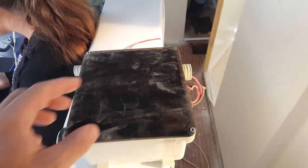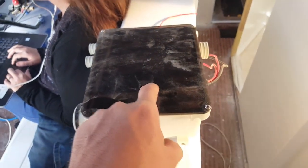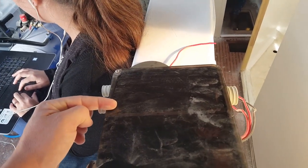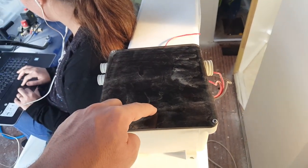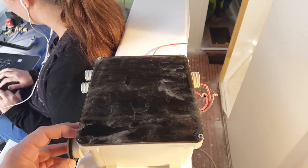So what happens is - I'm sure you guys are familiar with these, they're quite common. You can see through there, it is see-through, it's just dirty now because it's been in the dust. That's the pump outlet through there. There's a little bilge pump in here, inlet in there, and two additional inlets from whatever else you want to bring through. It's got a little sieve or membrane backing there so that any big particles won't go into the pump area. It kind of just catches big particles. The pump's got an automatic switch in it and pumps everything out automatically.